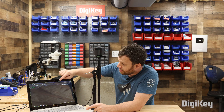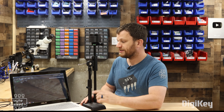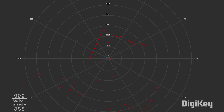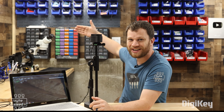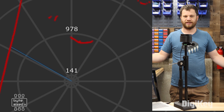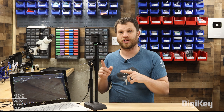That's kind of interesting — you can tell that one wall is very smooth, but the adjacent wall has blue bins and red bins that give those jagged edges on the graph. Let's see if those lines change as I rotate the sensor. You can see that 90-degree corner adjusting based on where the sensor is. Now let's see what happens if I put my hand in front of the sensor — I can see a tiny little red line that is my hand moving back and forth. I'm going to stand really close to the sensor and move further back, and there's a red line moving forward and backward. This demo is super cool and gets me excited about using this sensor in future projects.